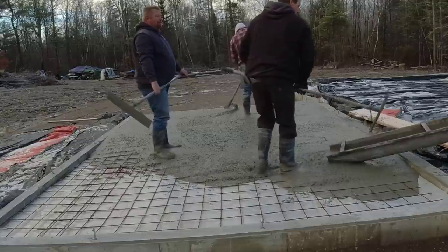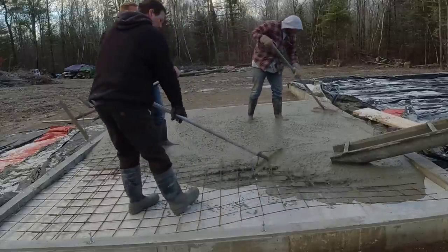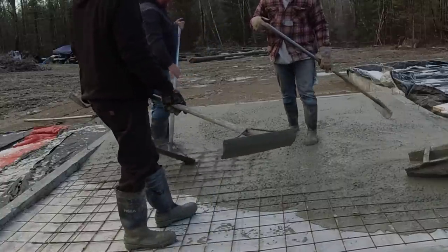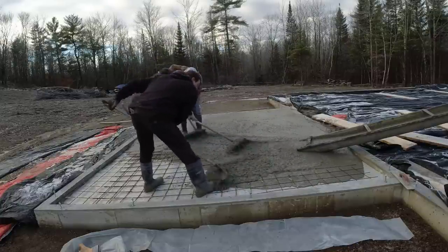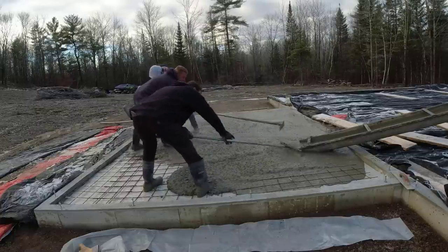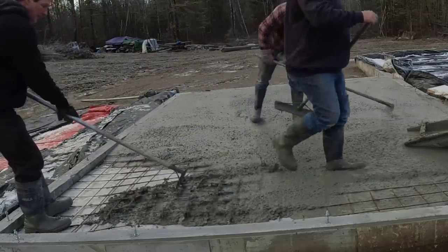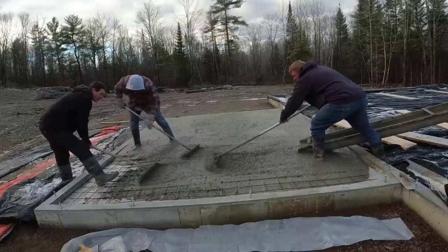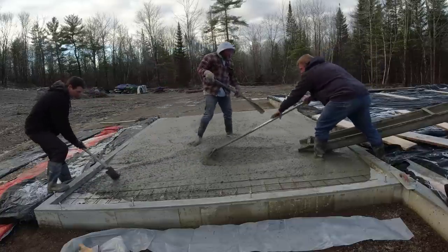I'm not even sure why they put wire — we had fiber mesh in the concrete plus 4,000 psi inside a concrete wall like this. With good compaction, where's the concrete going to go? The wire was kind of a waste in my opinion, but we'll pull it up a little bit to get it up into the crete. The stone in this mix is a blend — like ¾-inch stone with a little bit of ⅜-inch stone. It's actually not a bad floor mix, and when you add that extra cement with a 4,000 psi it finishes pretty nice by hand. I'm going to finish these by hand today — they wanted them smooth.